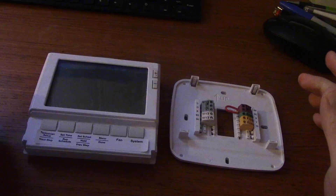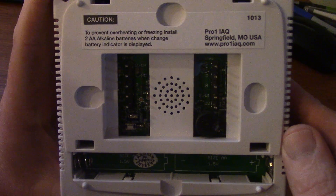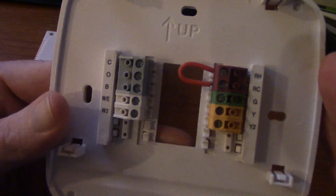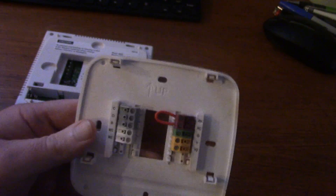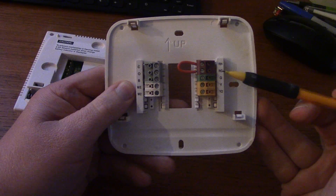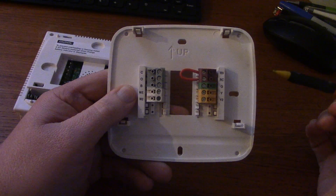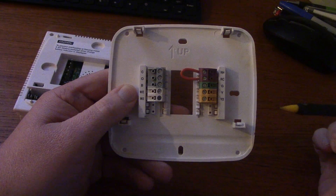So it's two parts to your thermostat here. You have your pins that plug into the holes on the sub-base where you do your system wiring. Notice on this thermostat, it has already installed an RH and RC jumper. You have to have that in place to have power for heating and air conditioning to work.